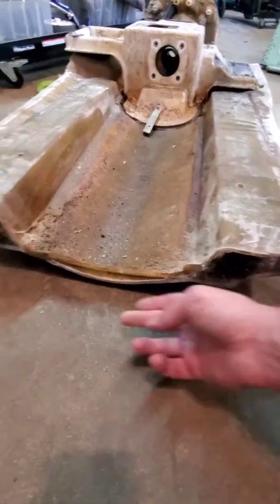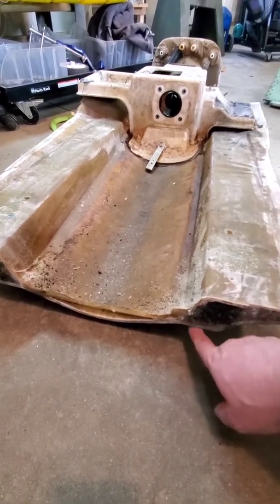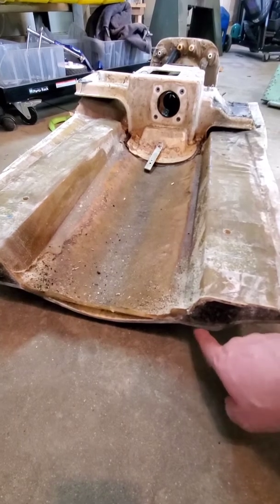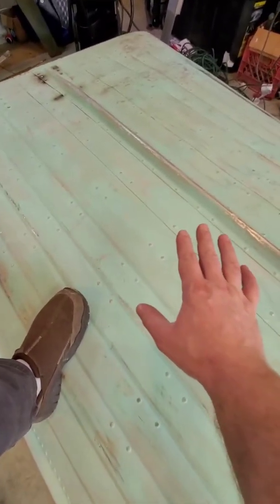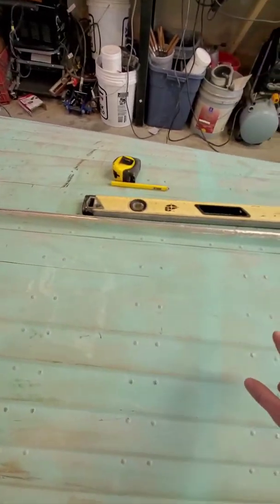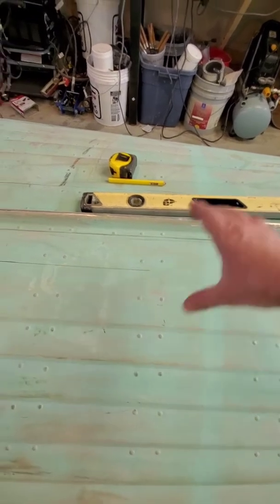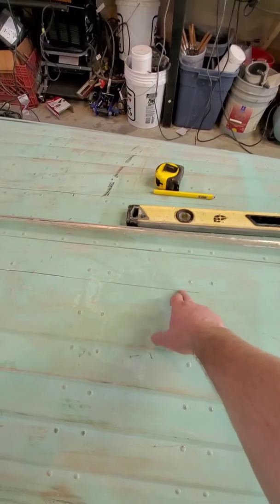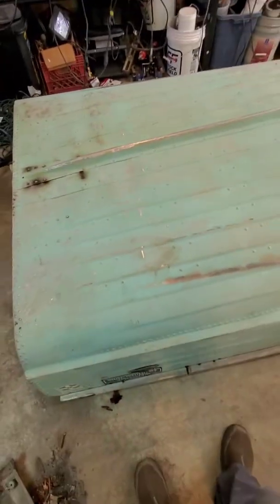These flat parts right here - there's one on this side, one on this side - run the full length. That's where this is going to make contact with the bottom of the boat. I think I'm going to put some aluminum in to strengthen it - we'll see what it looks like once it's in there. I also saw a video where somebody did something really smart - they didn't cut this piece out completely, they left it as a flap, cutting a little farther up so that when they put it in they could use this piece of metal to make a nice gradual transition. There should be a little gap we'll have to weld some aluminum into, but alright, onto making the cuts and cutting the bottom out.